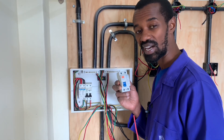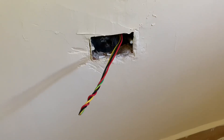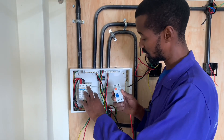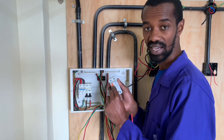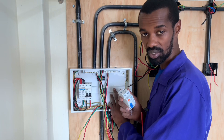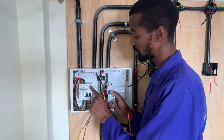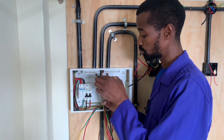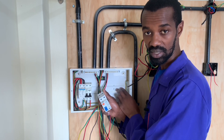Another important gadget here: the RCCB. The RCCB ensures that it protects your circuit and your appliances against electric shock. In case there will be any leakages, or there will be a current that leaks from phase to earth, it will trip the entire circuit — meaning it will shut down all the circuits connected to the MCBs or miniature circuit breakers. The output connection from the DP MCB or main switch will go through this RCCB, so that the output of this RCCB will feed the neutral as well as the MCBs connected here.